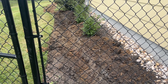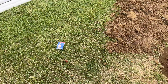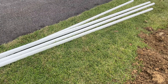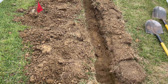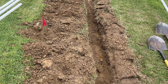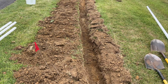We're going to make our turn and run it down through the side. This is the pop-up piece I was telling you about, and it will have adapters going from the inch-and-a-half pipe over to the bigger four-inch pipe. Any of the big box stores sell all the adapters you'd need. We also have connectors to join the pipes together, and of course we're going to be using glue to glue everything together.